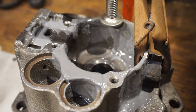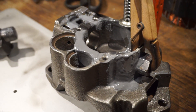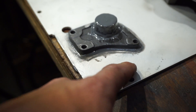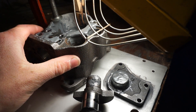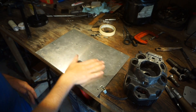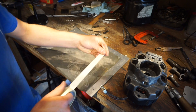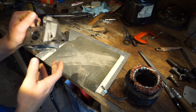Here you can see the crankcase is pretty much all done, just waiting for that glue to cure. Tomorrow morning I should be able to sand the whole top down and make it nice and flat so we'll have a nice seal there. Then this is going to be our cover, which we'll cut out tomorrow. It's the next morning and it's all nice and toasty from the light. Now I need to sand this all nice and flat — I've got a nice piece of aluminum and I'm going to tape sandpaper on it. That should work pretty good.